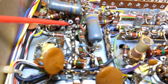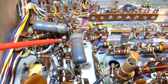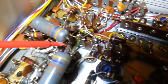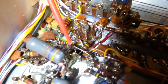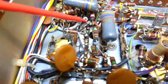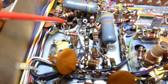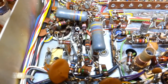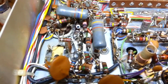This resistor here is basically in the center, turned to ash and broken in half. There's another one here that's burned up and not far from dying - it had actually been replaced one time before. You can see somebody cut the lead and tack-soldered it back together. The burned-up resistor that actually caused the problem goes to pin three of V401, which is this tube right here - the IF amplifier for the AM circuit. That resistor burned up, basically that tube shut down, and that's why AM disappeared.